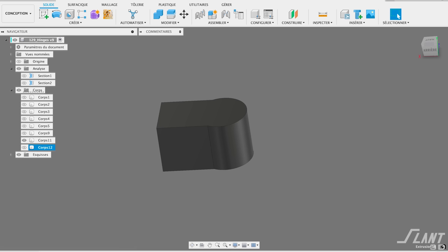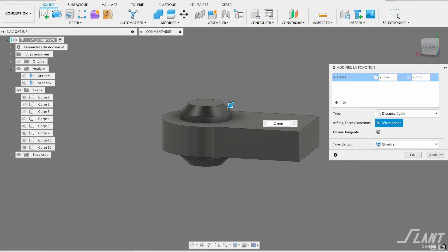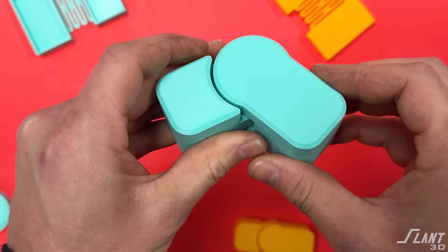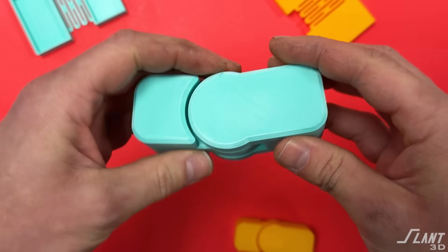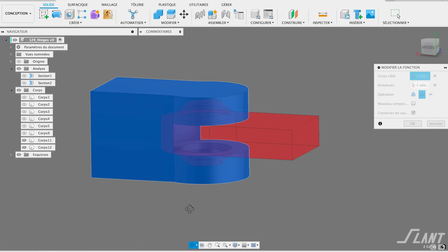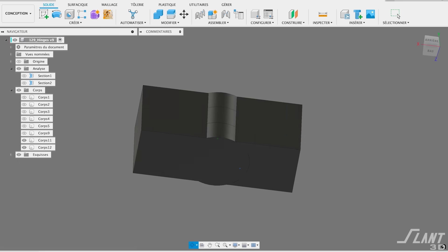If you make it large and chunky you can compensate for that a little bit, and there's one more hinge type that is actually way better at getting this done. This hinge is basically two cones on the top and on the bottom, which allows you to create a really robust contact point that doesn't have leverage. The single cone can break off because there's a lot of leverage on that arm — all the force from down here is applied up at the corner. But this double-cone one doesn't have a lever arm. The cones going into it are only a couple millimeters, so you have a lot of motion and strength and you're never going to break this off.